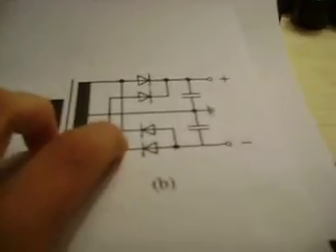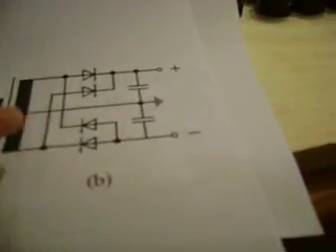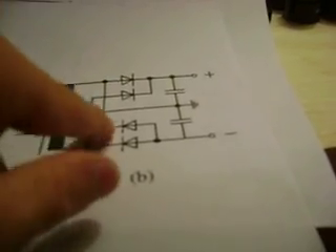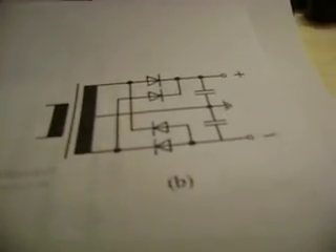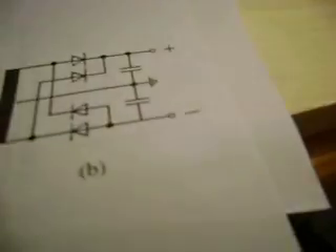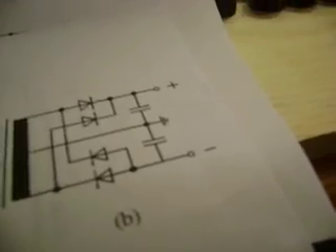From that, I'm going to use a full-wave voltage doubler, which is going to give me approximately 340 volts at peak voltage. I'm also going to put a current limiter on the end so the capacitors will charge up somewhat slowly, just slow enough that the circuit will be able to register it.